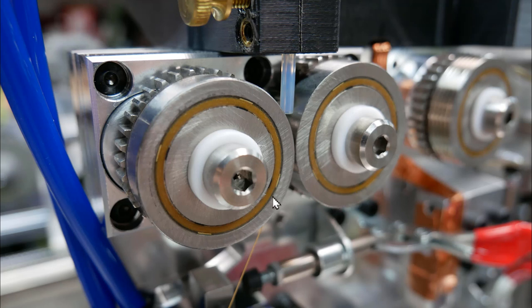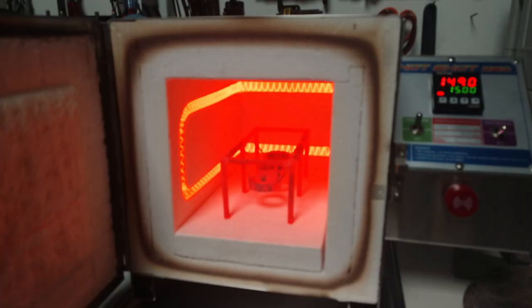Fabricating these gear assemblies required some special attention. I machined these rings out of O1 tool steel and then heat treated them to a Rockwell hardness of about C60. I did go ahead and temper it back — it ended up being somewhere between 55 and 60, but fairly hard so the durability should be really good. Like everything, there's a trick to doing these rings. I'm just about ready to pull them out of the oven and it's really important that they lay flat — basically they enter the oil laying flat. That'll help prevent warping and make them as uniform as possible. I did wish I had left just a hair more material because it came out exactly perfect when I cylindrically ground these on my surface grinder, but I could have had a little bit more material there. I cut it pretty close but they worked out good.